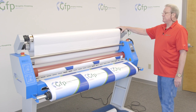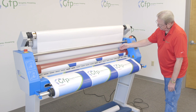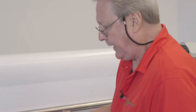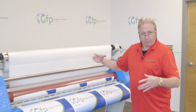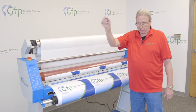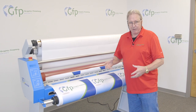Up here, when I get this going, I want to make sure that my liner floats out here a little bit. I don't want it to be tight up against that idler bar, because if you do that, you're stretching your film and stressing it. What will happen is if this gets mounted to a rigid substrate and goes into the sunlight or outside in southern states where it's really hot and dry, that vinyl will try to go back to its home position. It might take two weeks, three weeks, or a couple of months, but you'll see all kinds of tunnels running through your finished product.